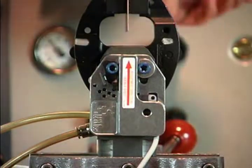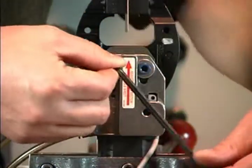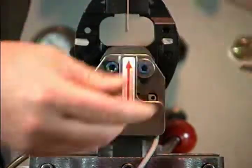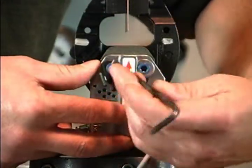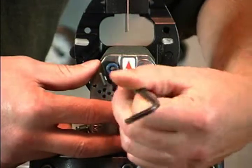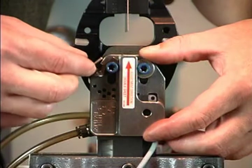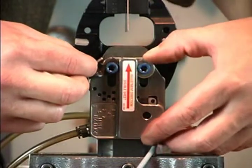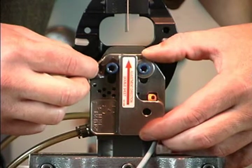Using air pressure, close clamp jaws with one panel between the tips. Loosen both screws and remove the lever from the locating hole. The double sheet detection option can be identified by the red arrow on the label on the switch housing cover. Slide the housing in the direction of the arrow, toward the jaws, until the switch just turns on.